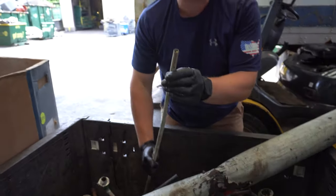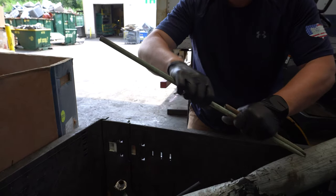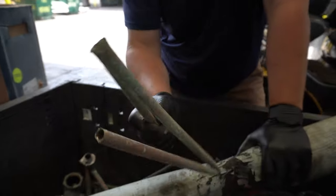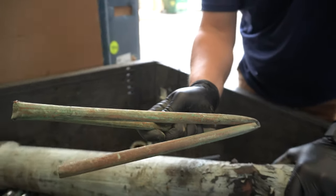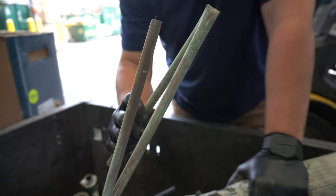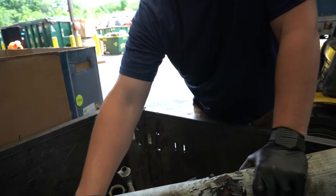Sometimes you're going to have different tubes that come in. These really thin gauge tubes cannot go with your regular brass pipe. They're going to be thinner, which means they're going to melt in the furnace and they could burn up quicker. So many times your scrap yard will not buy this as a clean brass pipe, so you just want to look at it differently.